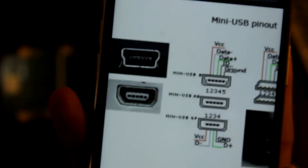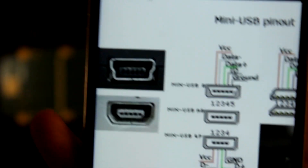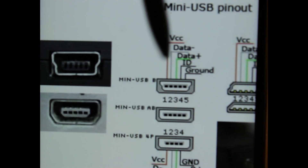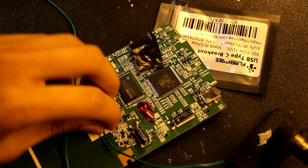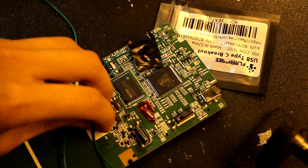And then let's see if our USB-C works. The only pins I really care about here is VCC and ground. I'll worry about data later if I actually need it. Alright, so this pin one, according to this diagram, is VCC.